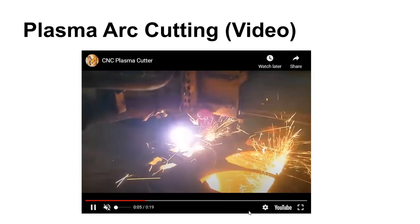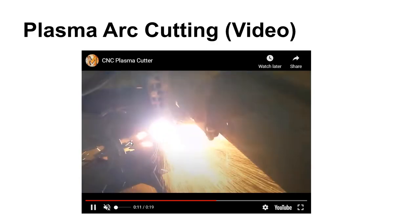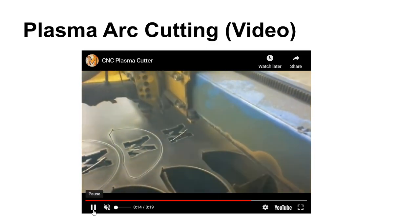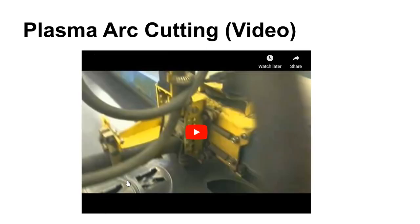There's a video of our plasma cutter downstairs — you should have some experience with this from the coat rack component in Tech 1711. Don't design a part to be plasma cut with little one-eighth-inch holes. Maybe a quarter-inch or half-inch hole is fine, but for precise holes you'll want to drill those. If you were laser cutting, small precise features are no problem; the plasma cutter is a notch down in precision.